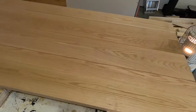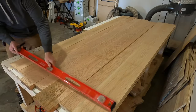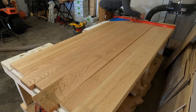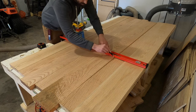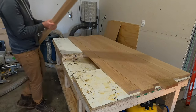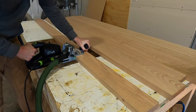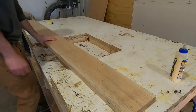This was somewhere around 42 or 43 inches wide, and here's a better look at all the boards that I had selected after I've milled them all up. I decided to use dominoes in between each board to help with the alignment — I don't normally do that and I would consider that a mistake. What I'm doing here is just making a line all the way across the tabletop on each joint. That will allow me to line the domino tool up on that line for when I plunge into the board and make the cut where the mortise goes. That way all the mortises on the boards will line up and those tenons will fit in there perfectly, keeping the boards aligned.